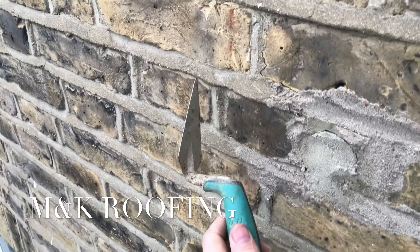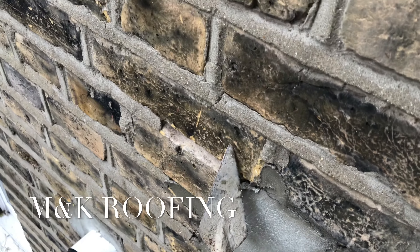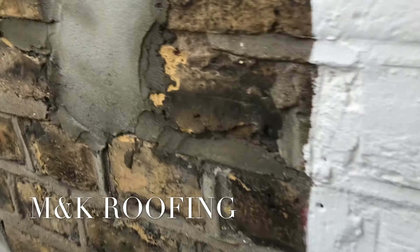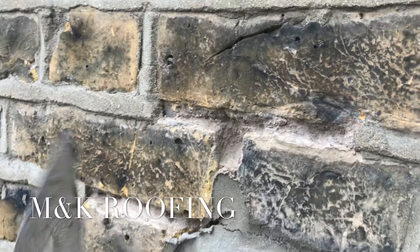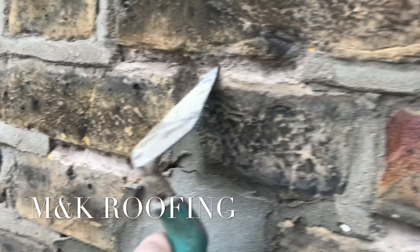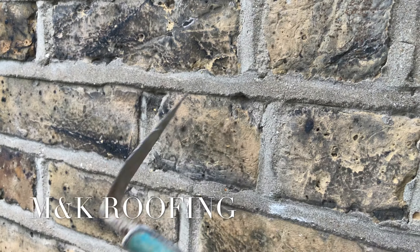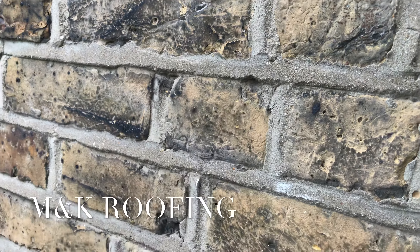The front face of the cement — the mortar — most of the time is okay. But if we have a look down here, we'll just pop this off. You'll be able to see the mortar turns to dust. So the front face is hard and the internal bit turns to dust. What this ends up doing is the headers start to move a little bit from the wall internally, and then you end up getting cracks in the front of the building.